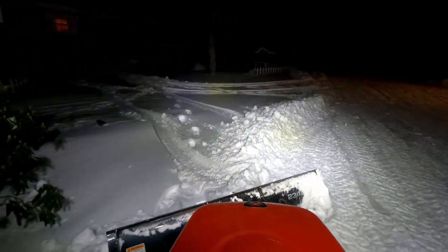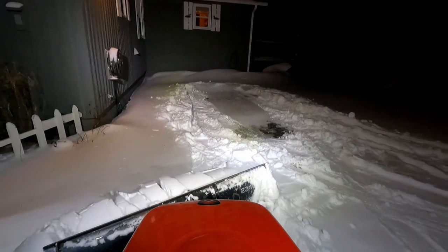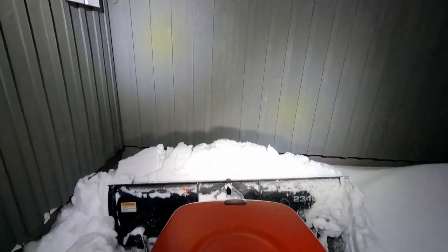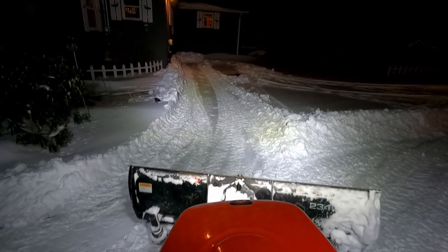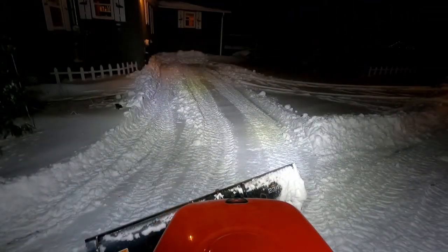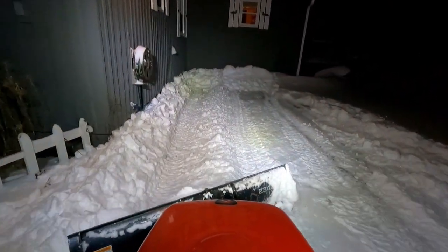Now I'm going to clear where I parked the car — I've moved the car out of the way. So you see here I'm going in front there by the back walk, and then I angle the blade towards the camp so I can push the snow up against the skirting. Our camp is just on posts and the skirting is wide open, and the wind just whistles through under the camp. So if I pile the snow up there it tends to keep the floor of the camp warmer. This helps keep the floor a little bit warmer by banking the snow around the camp. Now you see I just made another cut there, but I have another windrow right here next to the first cut I made, so I'm going to push that in against the camp too to get some more snow in there.